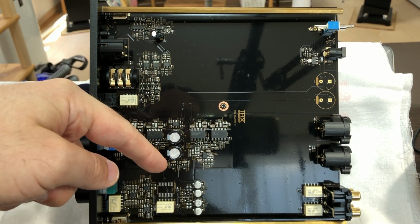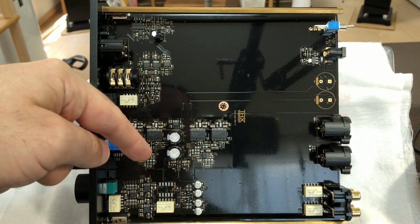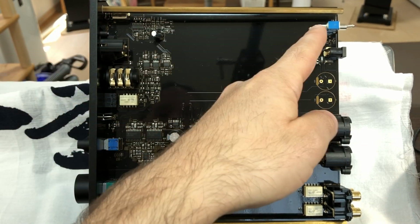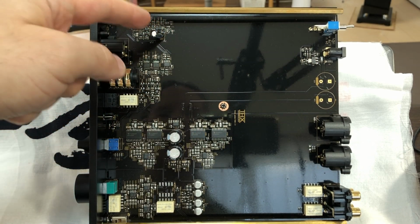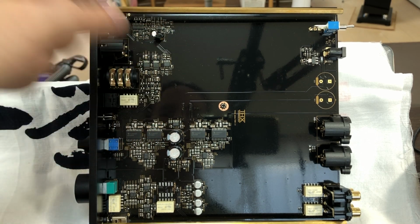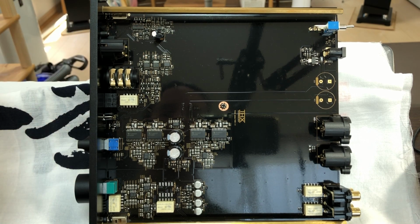But they've decided, of course, that's not necessary, and I guess these capacitors have some of that effect in the design. So we see the power coming through these traces through to the amplification circuit, and we have a switch here which is whether you want the auto power off, and that is probably connected by traces maybe on the other side or in the board through to this little circuit up here. This is where you have your switch to engage the power.